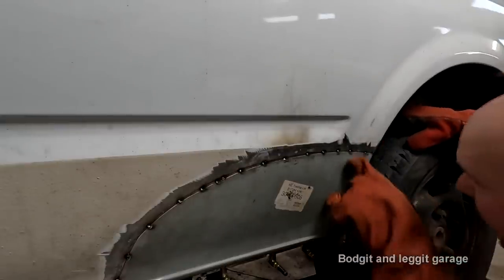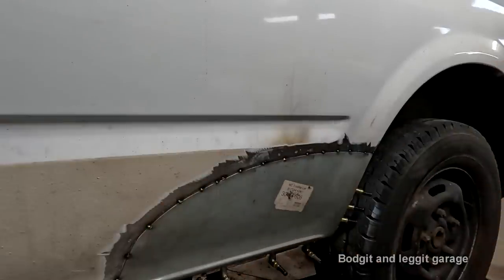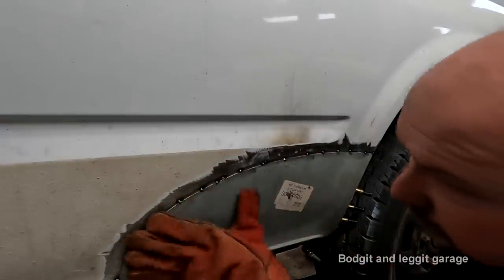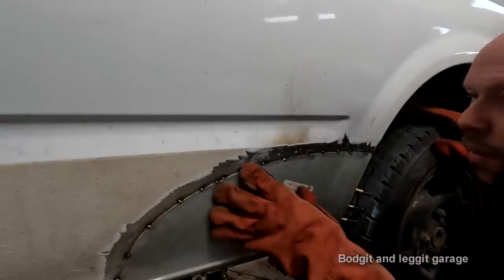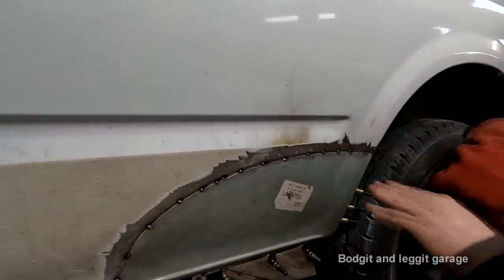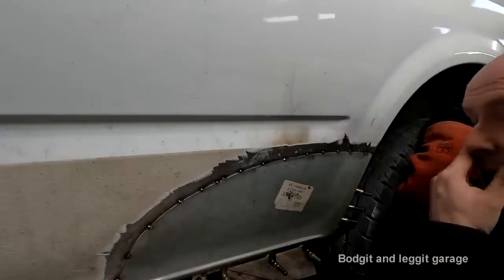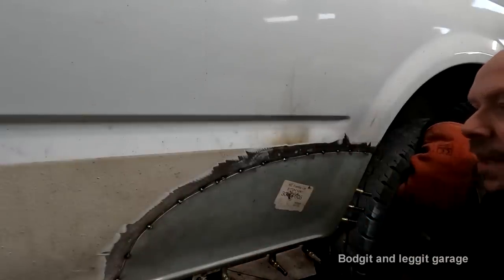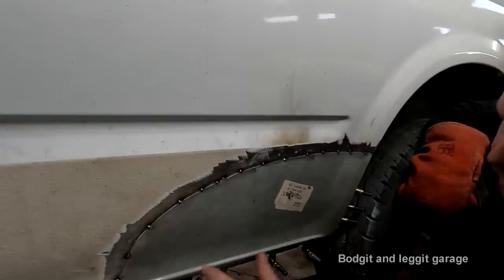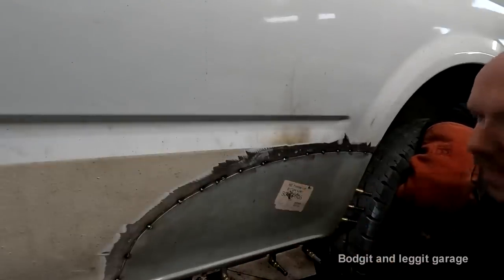Our first line of weld is on, and just feel that now, that whole panel, it's not warped, it's not tin canning. I could have got away with doing what I did before, but I would just be playing with a lot of mess and I'd end up putting a lot more fillers on. So cutting more of the metal off has made my life a lot easier.